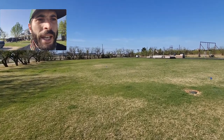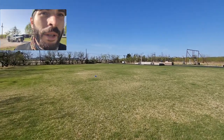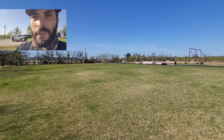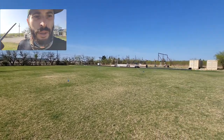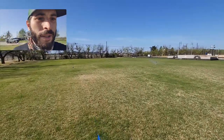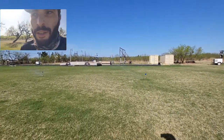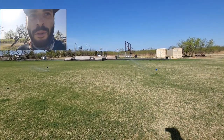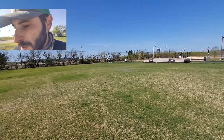This is 4838 Iberus Road — a Precision Turf install we did quite a few years ago with regular PGPs. The issue the homeowner is getting — you can see these circle patterns in the turf — shows the PGPs are working but there are gaps almost like circles. We've already adjusted the PGPs by turning the screws down to improve coverage, but in West Texas the wind is always a factor, and turning those nozzles down reduces the throw.